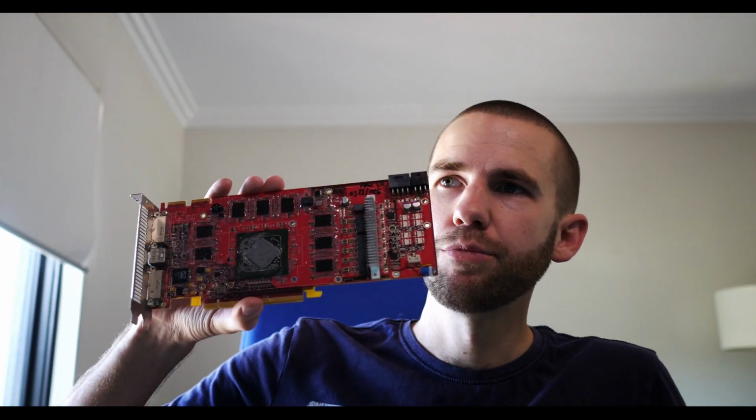This is the second Popa card, again with lots of VAS on it, because he likes to run chillers sub-zero, and also deshimmed. And here the volt mod is still intact, so this one came loose I think during shipping, if you can see that just about. But I can just copy whatever's going on this card on the other card, and then both of those should be working. It just means that today I have 3 working cards instead of 4.